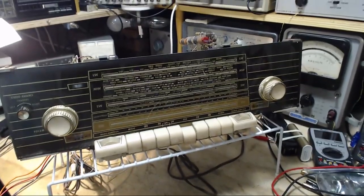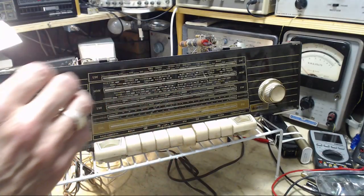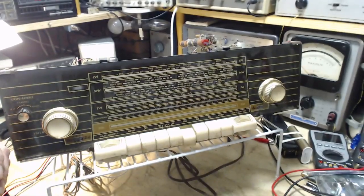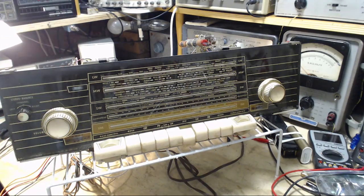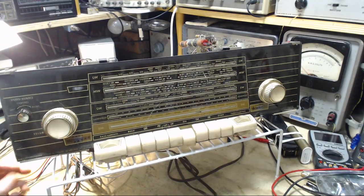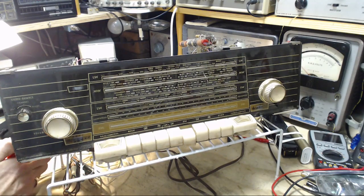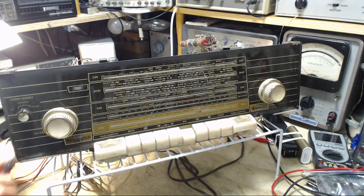Let's keep an eye on the dim lights. I made lots of significant changes right on the output transformer. Booting that up, not a recommended thing. Not recommended to boot that up. So I'm having another look at it, verifying that short circuit I kind of built into it is gone. Looking underneath here too. I left the wire tail sticking out. Should have trimmed it away. Trim away. There we go.